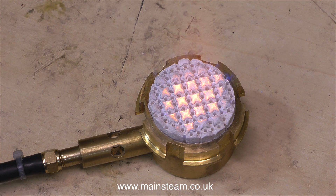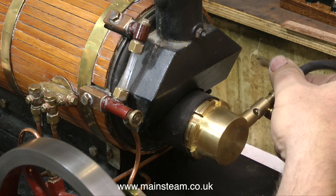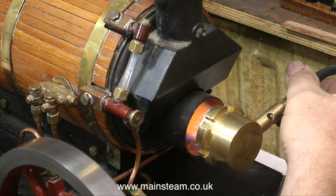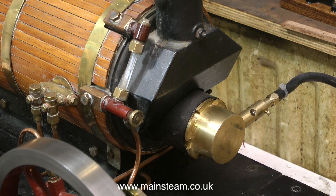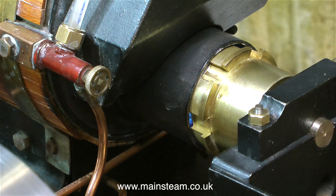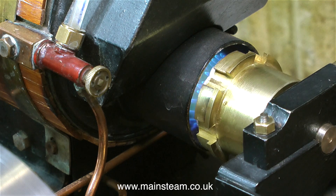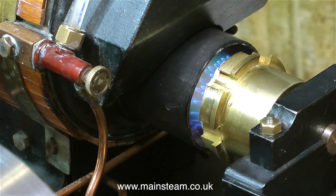This howling is a real pain — you put the burner in the boiler and it howls. It seems that some kind of resonance starts as the air moves through the boiler, and it's worse in this Scotch return flue because it's a longer flue. If I keep the ceramic burner outside the boiler — which is probably a good idea because it's quite fiddly to fit it — then I don't get this horrible howling noise. I've made an adapter to mount this in the holder, so I'll give it a try and see how well the boiler steams.